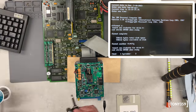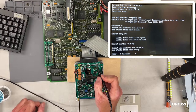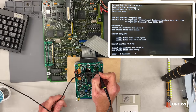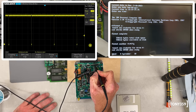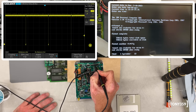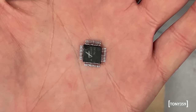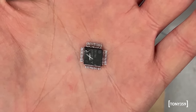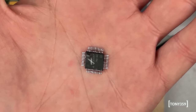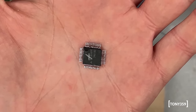Just out of curiosity, since we've been working on this drive for a while, let's inspect pin 8 and see what's coming out of it. Look at that — the missing index pulse. Welcome back! So this IC is definitely faulty — it's not working 100%, it's working-ish. That was definitely the problem.